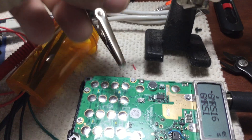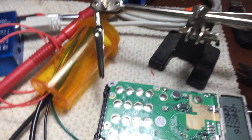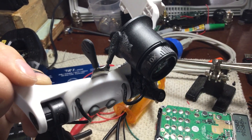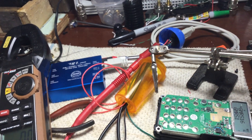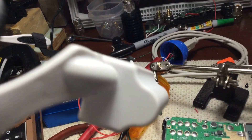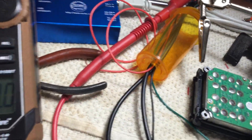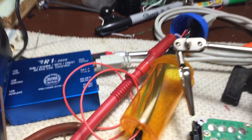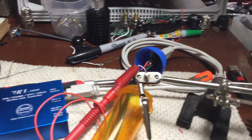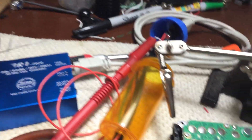I also used this to hold the wire in place. I recommend a magnifying lens — this one is nice because it uses regular triple-A batteries, not a watch battery. On your soldering iron, you may have to file your tip — get yourself a metal file to file your soldering tip to a nice point to get in here.